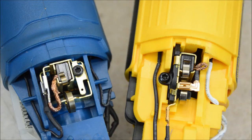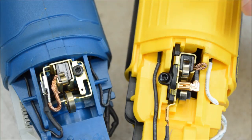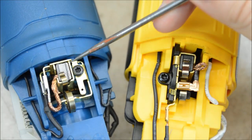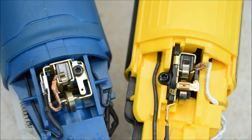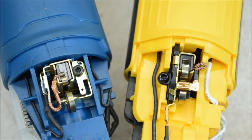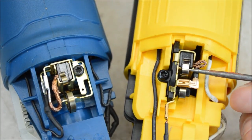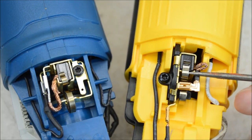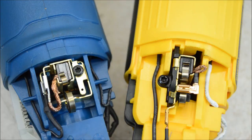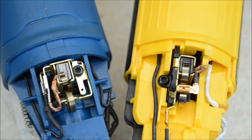Now we're starting to get into these things. We can see some similarities — they both use stamped brass brush holders. That's pretty normal. These ones are decently thick. I've seen on some other grinders I've taken apart really flimsy stamped brush holders that'll deform just when you're taking the brush out. Both of these look pretty good. They also both use a coil spring here to hold the brush in place and keep pressure on it. This design will keep good consistent pressure on the brushes as they wear, and a coil spring design also allows you to use a taller brush than some other retention designs.